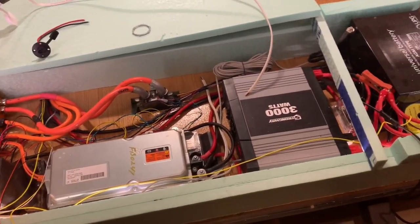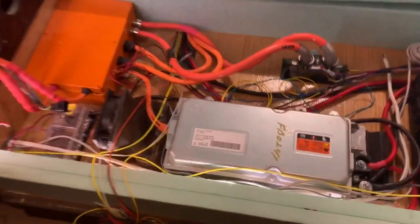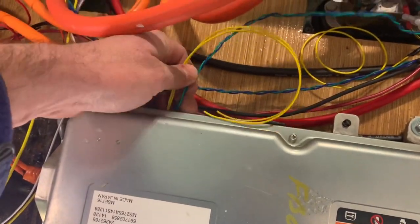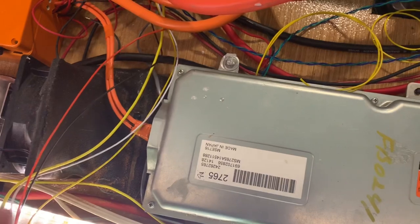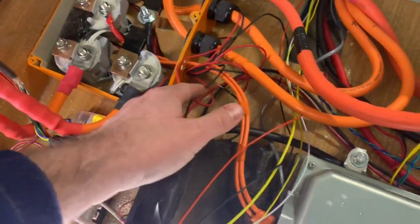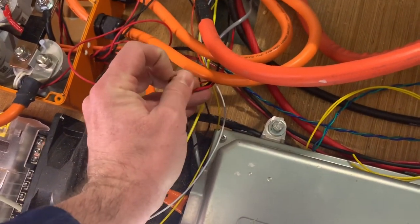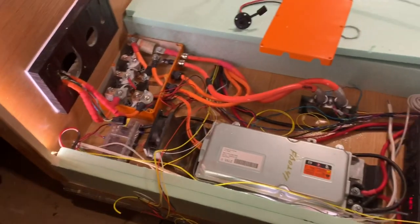I like the option to have AC in here maybe. I've heard air conditioners can operate off this. So all the 12 volt stuff is done. I even have the DC to DC harness wired. I bought harnesses off Mouser. These two go to 12 volt power — that's CAN right there in case I want to monitor it for anything. But really all I need to do is send 12 volts to these two wires, and this would close the contactors for the main battery pack. So if those had 12 volts, then all of this would have high voltage, and it should work.